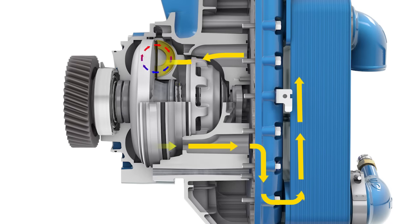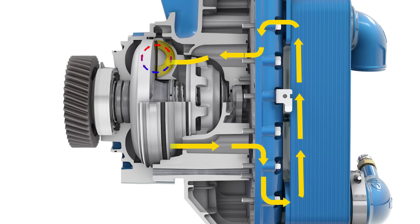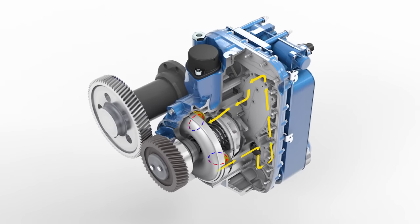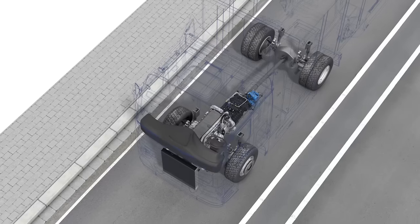The rigid stator redirects the oil and moves it back to the rotor. As a result, the rotor — and therefore via the step-up gear train, the prop shaft — is decelerated. The vehicle is decelerated.